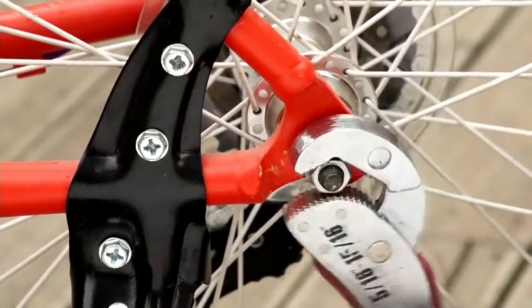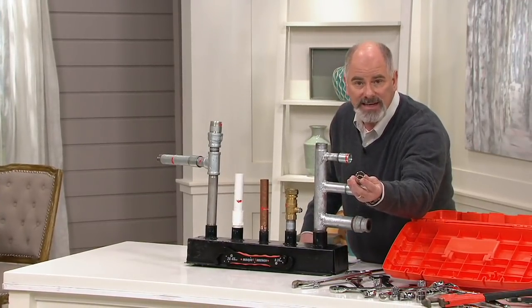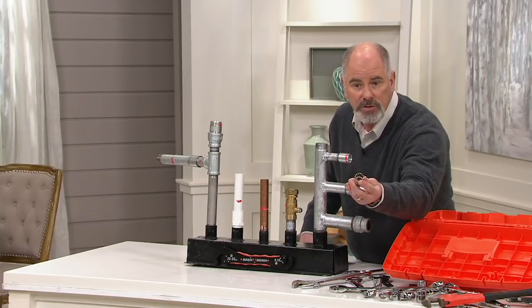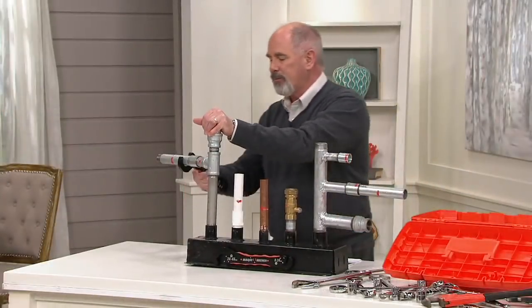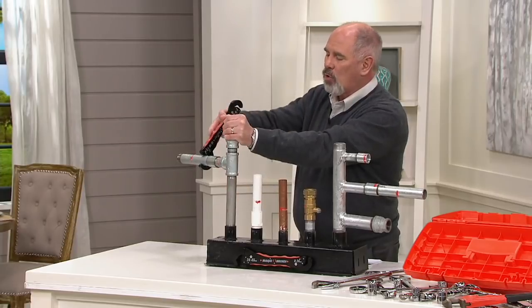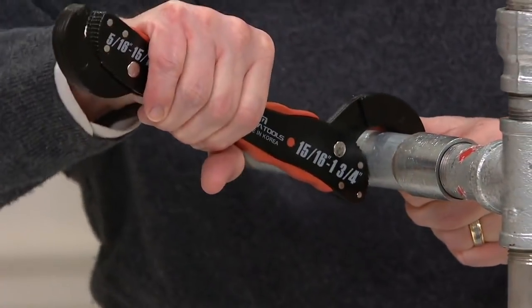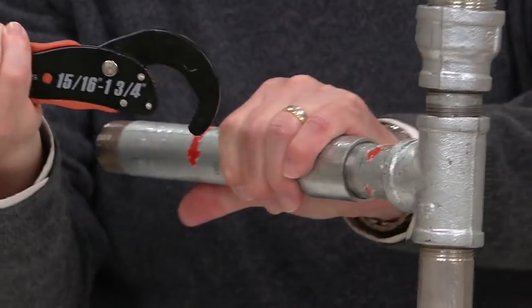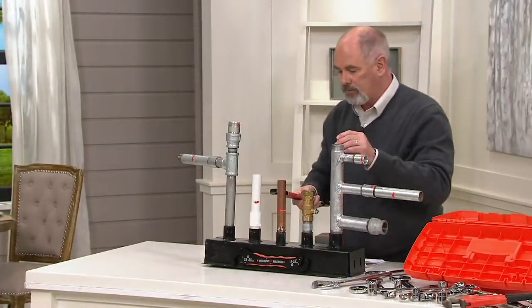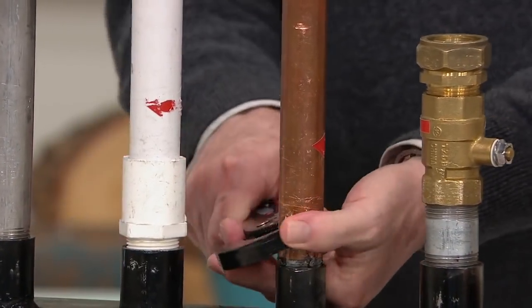What's really impressive is if you work with a socket set — if you've rounded off the edges of a bolt, a socket doesn't help you. You can't get grip to loosen or tighten it, but with this you can. We set up a pipe demonstration here. It just grabs hold very quickly, and you've got the torque to really ratchet down on something and keep twisting. It slips easily when you need it to, but grips whenever you give it any torque. It also has a ratchet action — it only grips one way, so you can ratchet one-handed without lifting and repositioning.